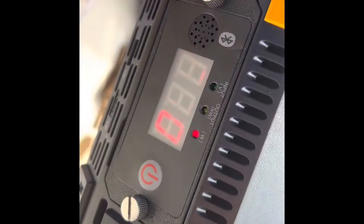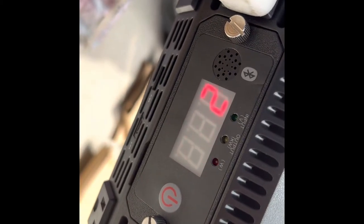We're charging at the rate of 12.5 volts at the moment, and we've got a 210 watt draw off the power inverter. If you follow this cord all the way back here, it runs right into the back of the refrigerator. It's plugged in and it's getting cold. That refrigerator only pulls approximately 250 watts peak, so to run it continuously I need approximately 300 watts of solar power.